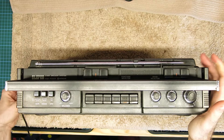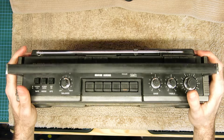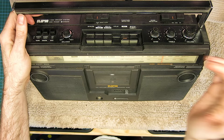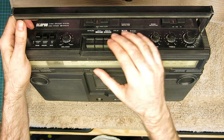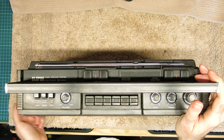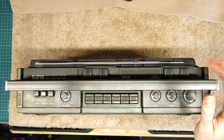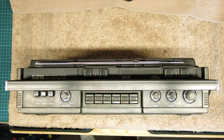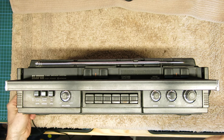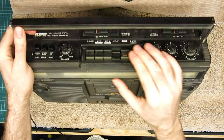I've just tried to power this up from the mains and I can hear the transformer humming but it's absolutely stone dead. I wonder if, because I've used the 9-volt socket on the side, the switching contacts in there might be dirty and I've probably just disturbed it — because if I put in the 9-volt supply it works.